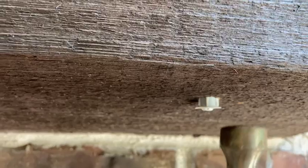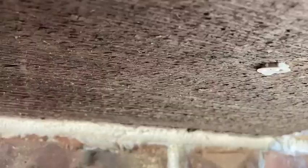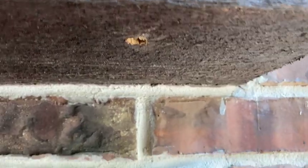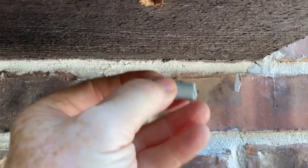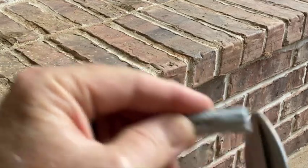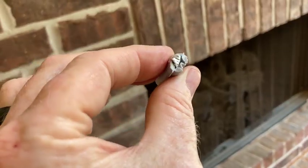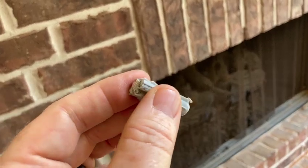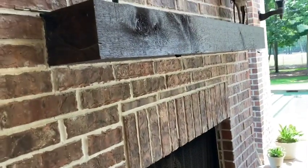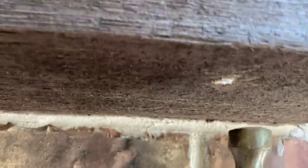I'll take my hammer — I'm doing all this with one hand. I pulled it back out of the hole because I had an epiphany: why don't I just go ahead and cut the flange off the wall anchor? Just put it right on the end and snip it off. Basically what I'm doing now is cutting off the flanges as well as cutting them to length — they will recess up into the hole a little bit, sticking out less.